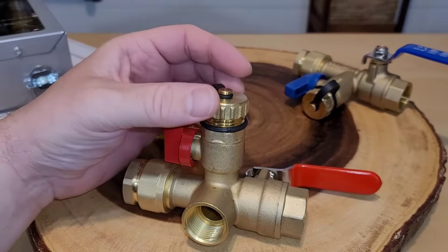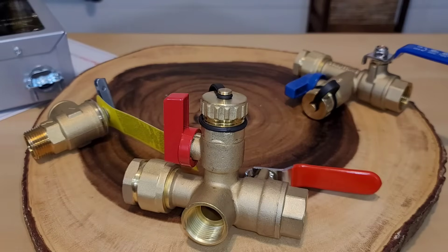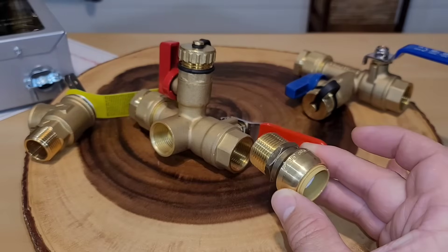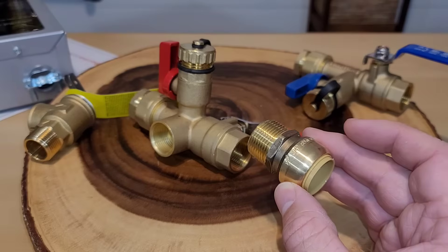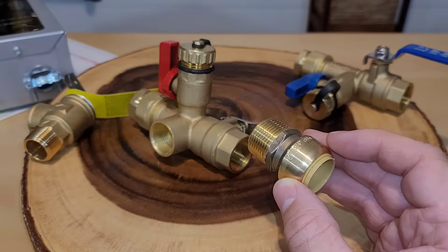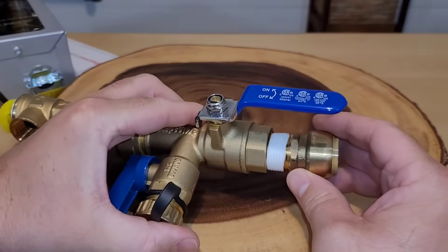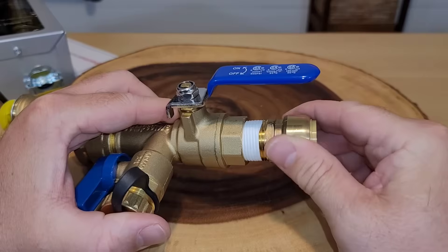I'm going to set these diverter valves up and install them to our tankless water heater before we get started. I also picked up two male threaded PEX ends to hook to the bottom of the diverter valve, and my PEX tube will go in here. I'm using shark bites — I know some people may not, but I think they're quick and easy at about $13 a piece. I typically wrap Teflon tape around five times before installing, and I'm installing by hand for now, going back later with a wrench.